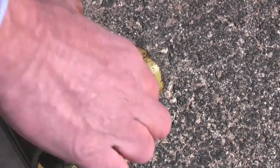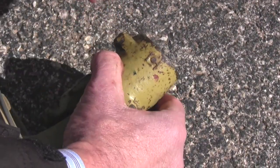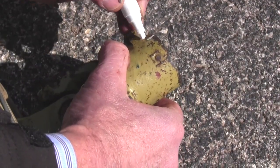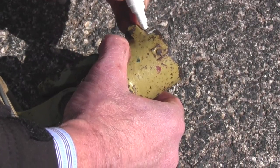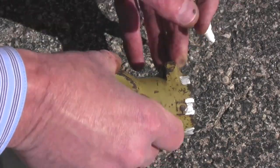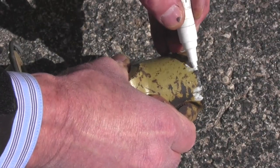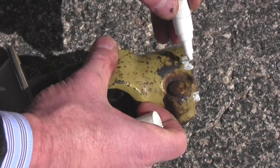If you've got a PTO shaft that looks like this, a PTO yoke, we're going to paint where the splines are inside the PTO shaft. And that's going to make it a lot easier for us to line this shaft up with our tractor when we're hooking up. Now, this is a PTO yoke off of my post hole digger — that one's real easy.